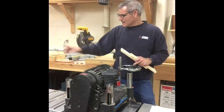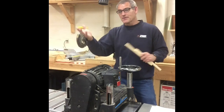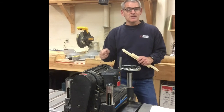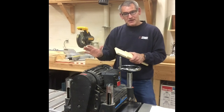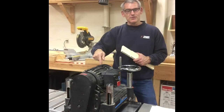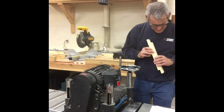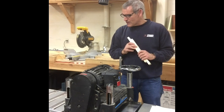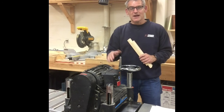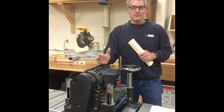The offbearer — the person on the other side, your partner — their only job, just like with all equipment, is to hold material so it doesn't put strain on the equipment and so you don't have to balance a long piece while pushing something through. You just concentrate on pushing and keeping things up against the fence; all they're doing is holding it and letting the operator or the machine push it through. Always follow your PPE rules — there will be PPE questions on this test, so take it as many times as needed to get 100%.